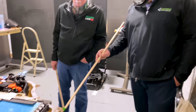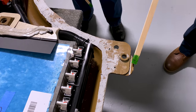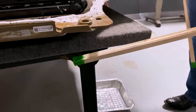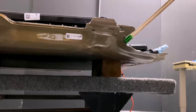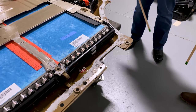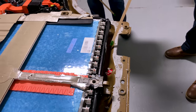Tesla has also increased their sill structure compared to the Model 3 and Model Y. You can see that concentric weld holds on another plate that's used to give more rigidity to the battery pack. When you look from the bottom, it comes back in about six inches, so they're getting some structure all the way to where the battery pack starts. There also seems to be a bigger gap — around 25 millimeters — again for impact, so there's room for the battery housing to flex and deform inward before hitting the battery modules.